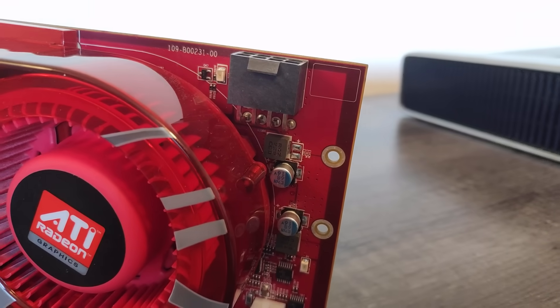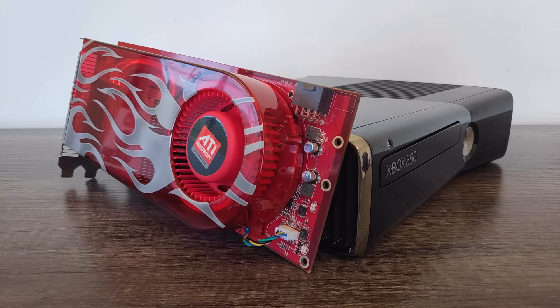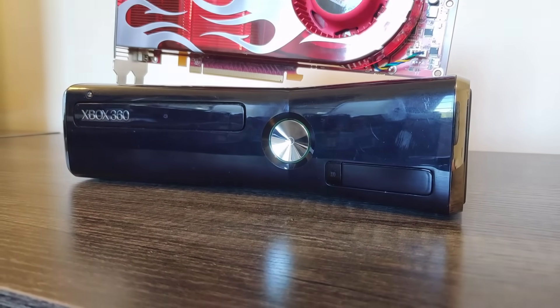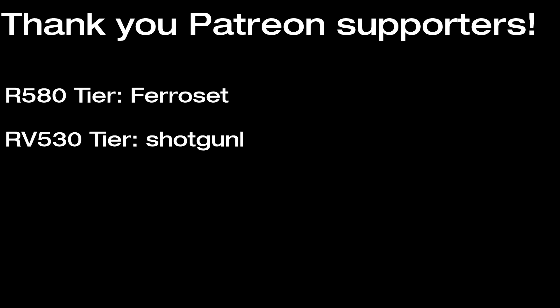In the end, is this card exactly like Xenos in every aspect? Definitely not. But if there were to be a normal PC graphics card parallel to it, then I think you couldn't get much closer. In many respects, Xenos was this sort of proto-R600 GPU, and this really shows in all the things they share in common: the five-way shader units, the tessellation engine, memory export. That stuff didn't just come out of nowhere and shows that for R600, ATI built upon the 360 GPU's foundations with the goal of tailoring it to the PC role as well. The 2900 GT isn't a flawless equivalent to Xenos, but it is an equivalent, which is more than a lot of other graphics cards can say. Special thanks to the first R580 tier Patreon supporter, Pharaoh Said.